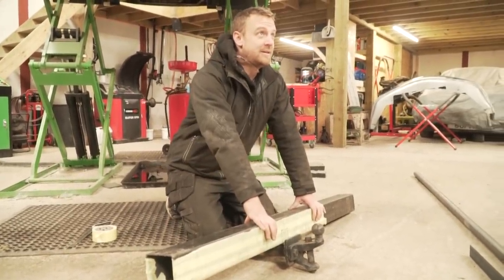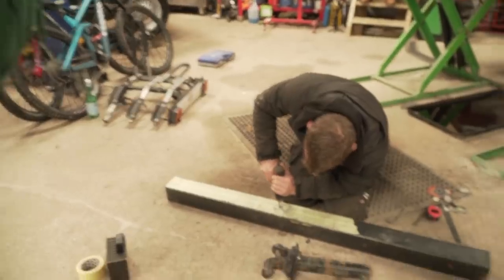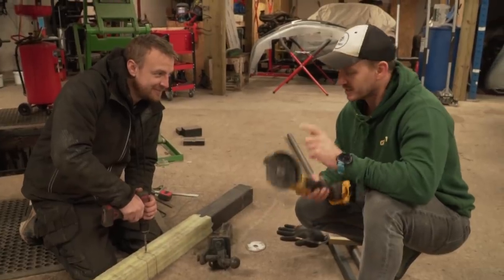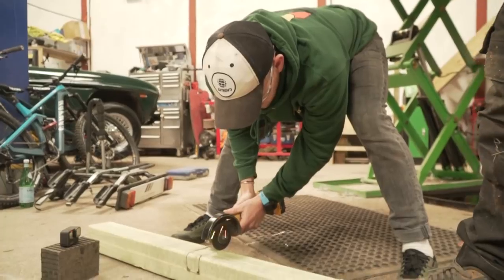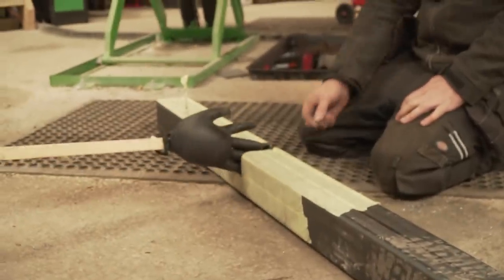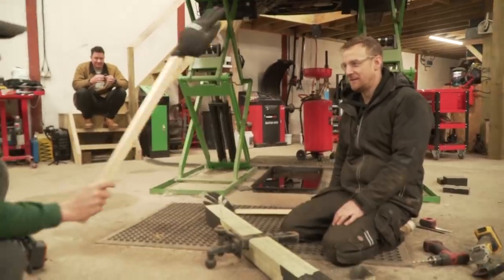Time to cut — I'm safe. I know woodwork but Martin's going to make it easy for me by drilling at the bottom so I can't go too far. Keep it dead straight, otherwise the blade could snap and we don't want the hole too big. It's always better to make it slightly too small than too big. It comes out — will it fit? Yes! Well done Blake, good teamwork, good grinding.